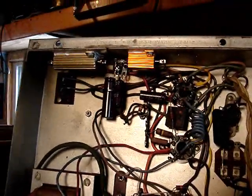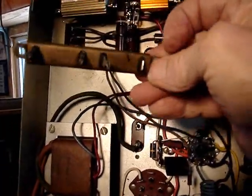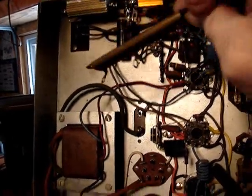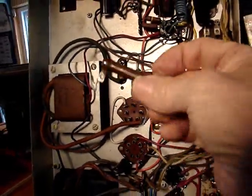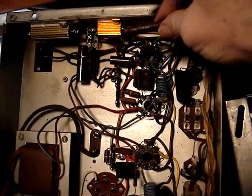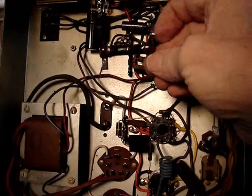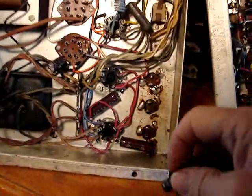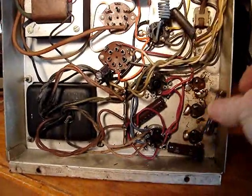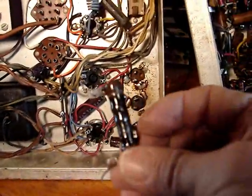Now you see those chassis mount resistors I have, that replaces this two-section can-ohm resistor that some other technician had bypassed years ago. I remember he used this power resistor that was mounted right about here. I've eliminated that with this one here. And then the melting 650 ohm resistor, he had it originally mounted right here, and of course putting it there, heat goes up, and these capacitors were always heated up from the heat from this resistor.